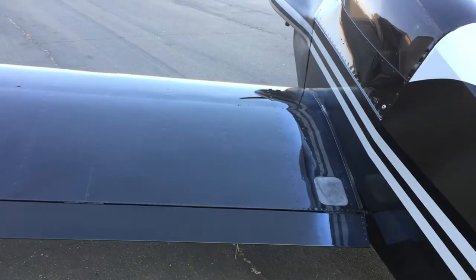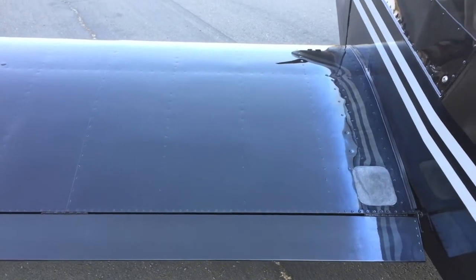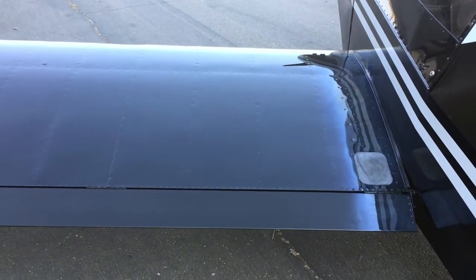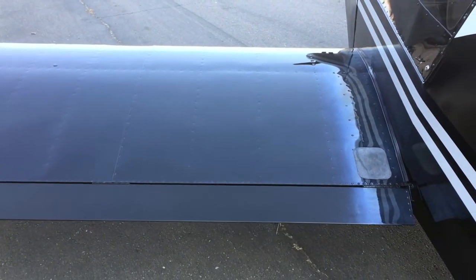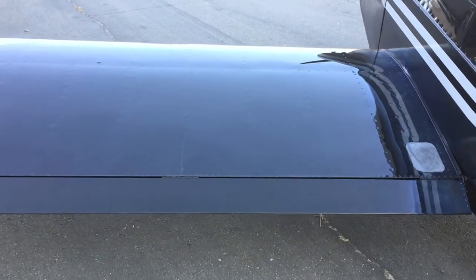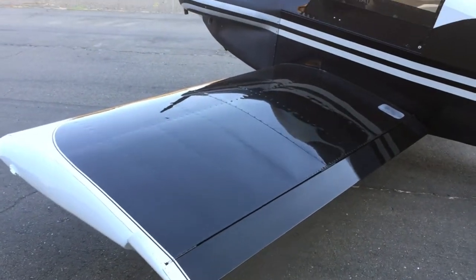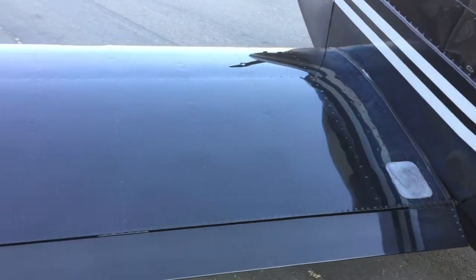And then here I pulled back the wing skin, the inboard section of the wing skin. I did that S mod to the wing, so it's all beefed up. Drilled off the top spar cap and added that angle piece, and all the rib attach support brackets. I got that documented pretty well. Got a bunch of pictures for it, and they're also all on the Sonerai forums at sonerai.net. And then I also added a support there for the wing walk area, so you can walk on the wing no problem.